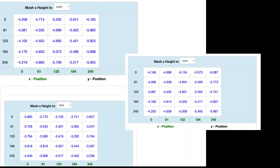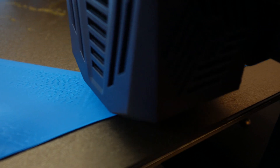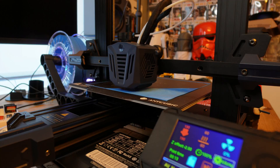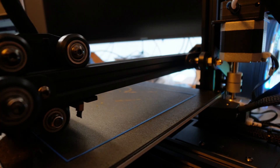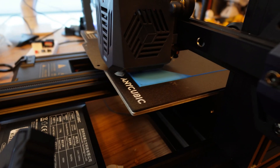I ran a series of tests mainly around bed levelling and deviations in the bed. The top left and mid right are values I took before I took the bed apart, and the lower left — mainly flat with one high corner — is what I'm running now. The software running on OctoPi also adjusts degrees to get the bed completely flat. This should be handled internally by the bed levelling processing, but I'm still getting these deviations. One important factor for kit printers is ensuring the eccentric nuts and extrusion are tight. Adjusting the eccentric nuts on the gantry did make a small difference, with slight deviation in left and right height.